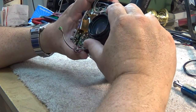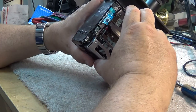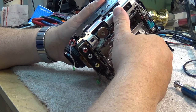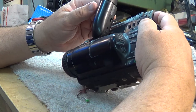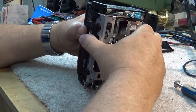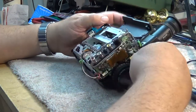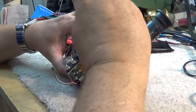I've already tried to play a tape and got exactly the same type of picture. So I know that the problem is common to both playback and a live camera signal. That's telling me that the problem is in one of the common circuits that feeds the video output.